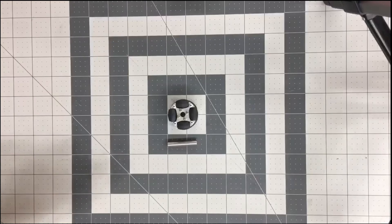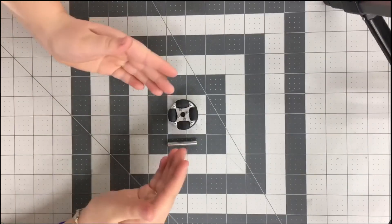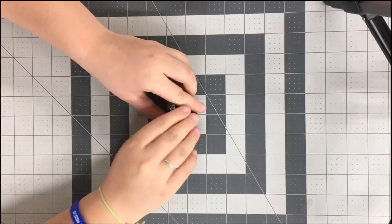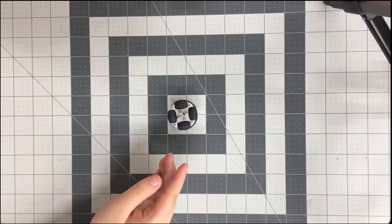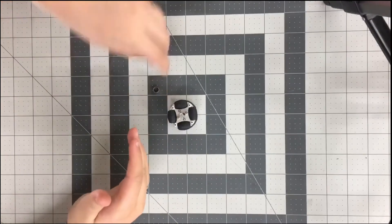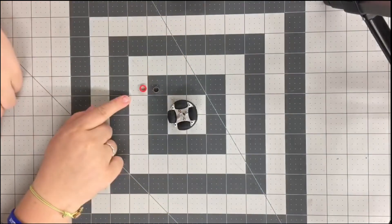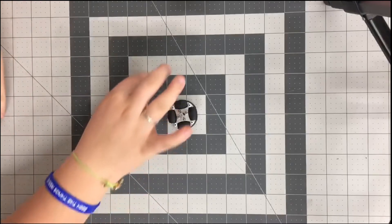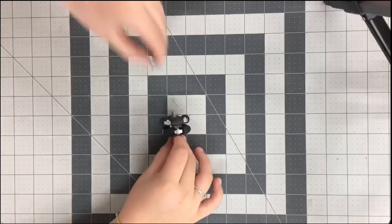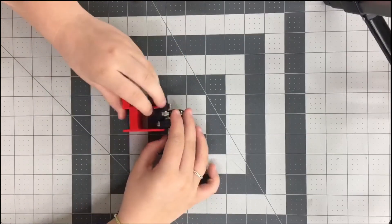Now, as you can see, we have the wheel with the proper size hub and the proper sized shaft, and they both fit. We also decided to machine some of our own spacers instead of using the 3D printed ones, because the 3D printed ones were too wide and not tall enough. These now fit properly on both sides, which will help center out the wheel in its holder.